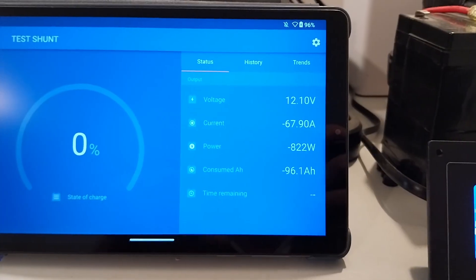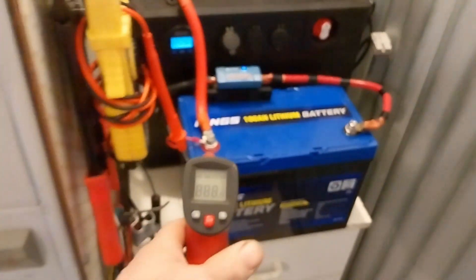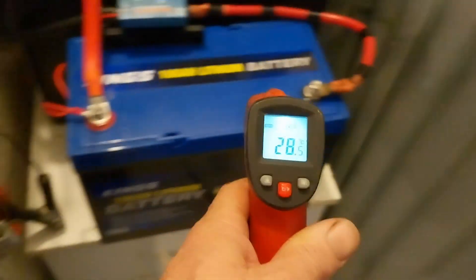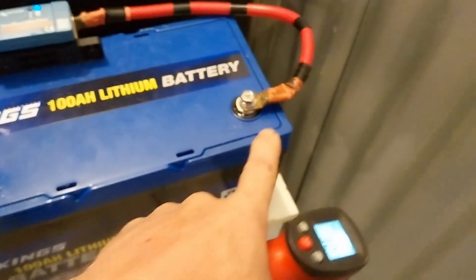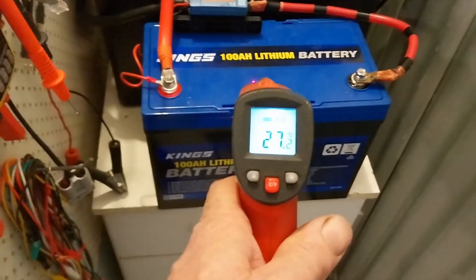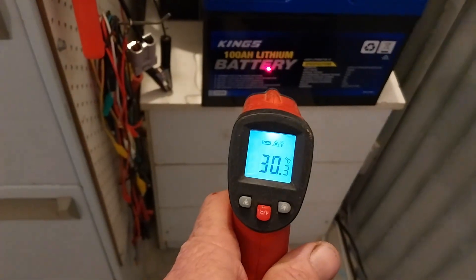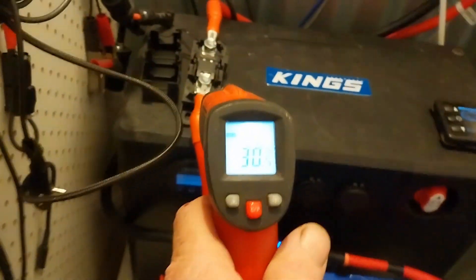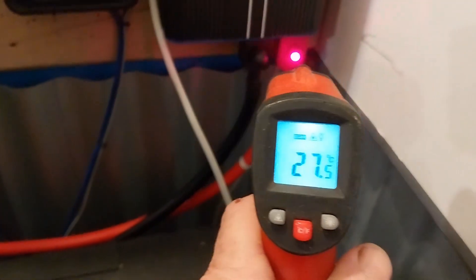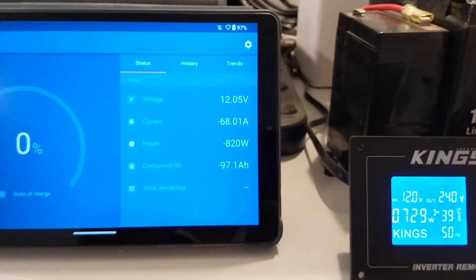I have done a review and test on this inverter — the output is pretty close to the money so it's pretty accurate. It just hit 12.1 volts and we're at 96 amp hours out, so I reckon we're going to make it. I want to quickly check the terminal temperatures before it shuts down: we're looking at 28 degrees on one terminal, 31–32 on the other — I'm putting that down to the crimping there. The battery temperature on the case itself is also looking good, and this has been running for about one and a half hours.